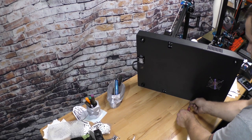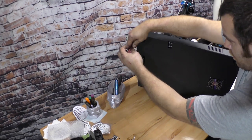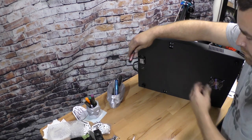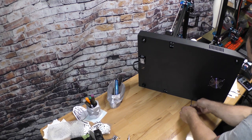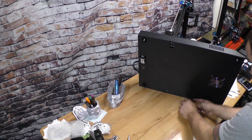The only other thing I've changed on them, which I only changed once, I went to a hardened nozzle, because my son likes the glow-in-the-dark filament, and I was told that really wears on nozzles quickly. So I figured, put a hardened nozzle in it and never have to worry about it again. That's basically what I've done, and those hardened nozzles have stayed in.